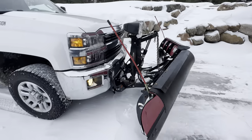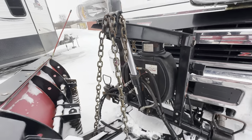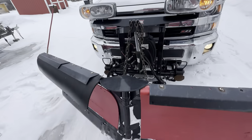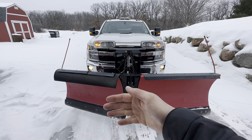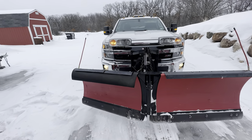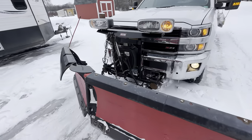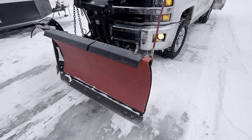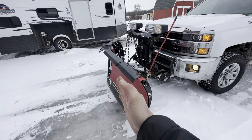If you ever go to do any back dragging, all you're doing is back smearing — that's all that happens. It has a chain lift, so it has zero down pressure. The plow just goes down by its own weight. When you hit hard pack snow or where the plow comes by at the end of the road, anything hard — it's only the weight of the plow cutting, so the plow just tends to go up and over. I know the new V-plows have down pressure, which helps, but it's still not perfect.